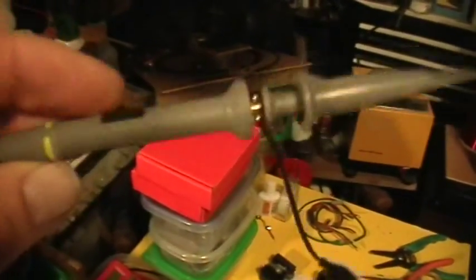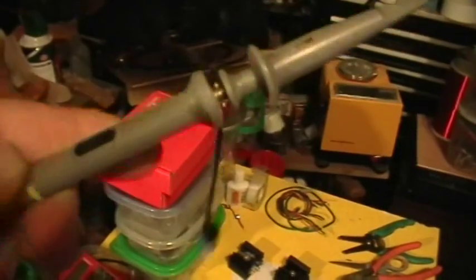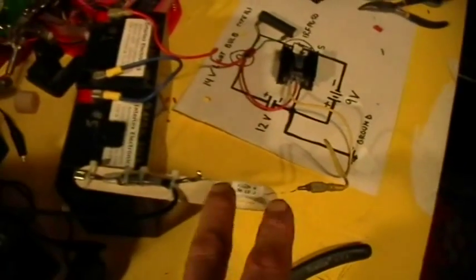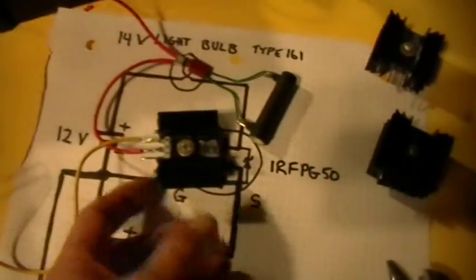I've got an ordinary oscilloscope probe, also set to no attenuation, okay? This is on the 1X side, I don't know if you can read that. No attenuation, and I'll be hooking that probe across this 1-ohm resistor with its ground reference here, just like the Kelvin ground reference, and the probe end here. So its current direction will be inverted from this, but they're both carrying the same magnitude of current because they're in series, right? Okay, and then that is the current sense resistor for the Q2 portion of the Ainslie circuit, right?